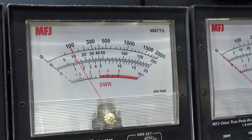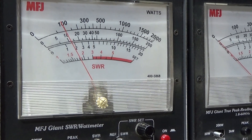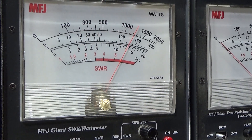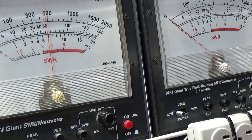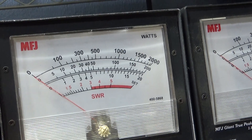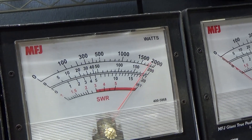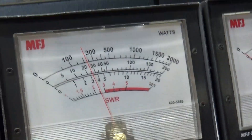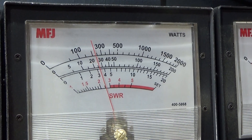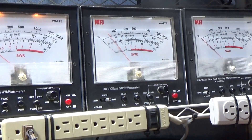I'm gonna turn the amp on and go to the 200-watt scale. That three-watt radio going into it — dead carrier at 10 on the 200-watt scale. Audio talking about 125 watts average with the little three-watt radio going in, swinging to about 10 dead carrier and 125 on average audio. On peak, on the 200-watt scale, it's doing about 250 peak watts — around 240 audio peak watts. Not bad for this little one-tube modulator, the Mako 75. We're gonna have fun putting that into some 500Zs. Anyway, that's it on this one — bye.